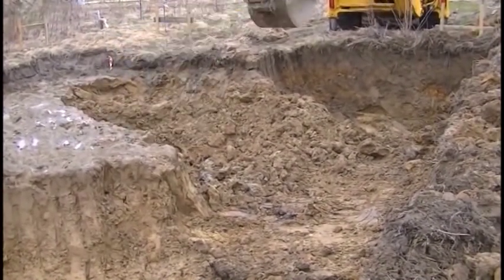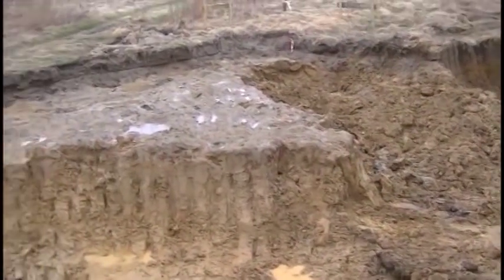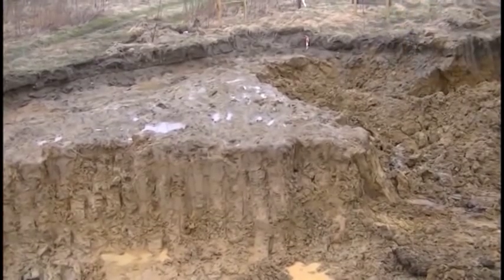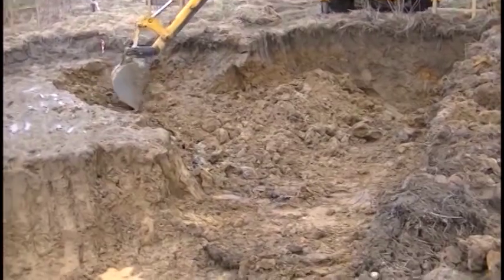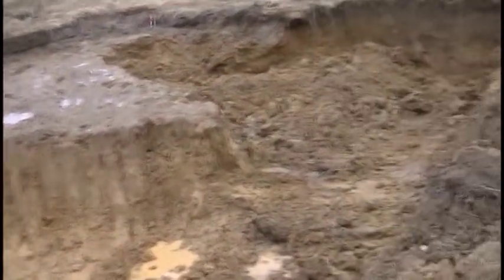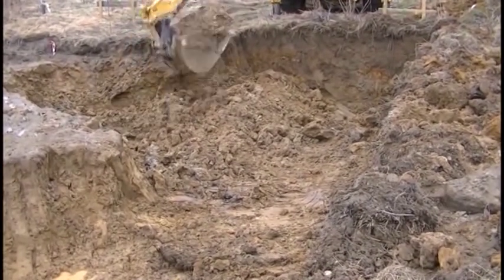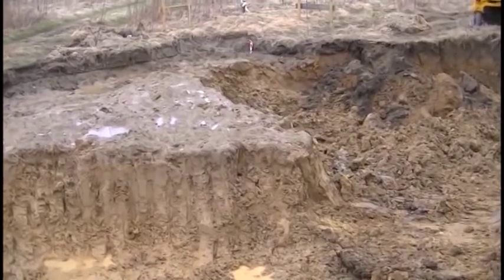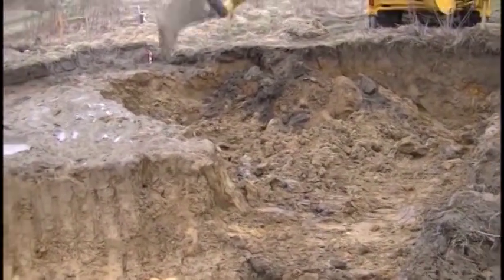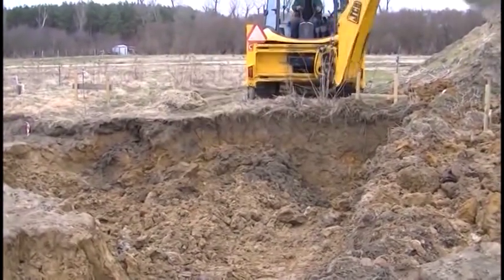The soil presented here is loam. Loam as a rock is considered to be suitable ground to erect a building, nevertheless we have to fulfill certain conditions. The first and most elementary is that we cannot disturb its natural structure, therefore we will have to dig the strip foundation trenches by hand. The other condition is that we cannot let such a pit become soaked. These conditions are very difficult to meet, but we have a chance to fulfill them and backfill the strip foundations before the spring thaw weather, due to the slight frost still present.